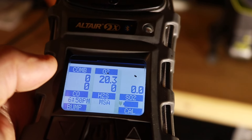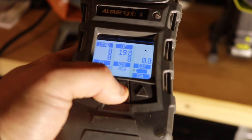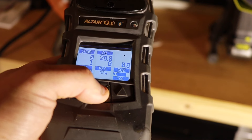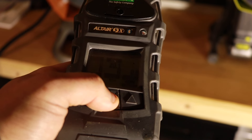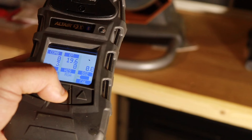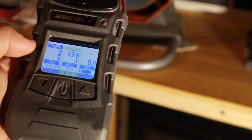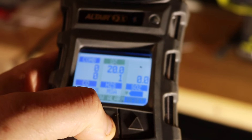It's only been about two minutes and the CO will start going up higher as it sucks that air out. We're down to 19.8–19.9% — only two and a half minutes in. At 19.5% it'll alarm. There it is — 19.5%, oxygen deficiency alarm going off! Carbon monoxide starting to go up: 5, 6, 7 ppm. Oxygen dropping to 19.4%, CO at 8, then 9 ppm. We're at 19.2% — shutting her down right now.